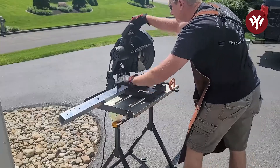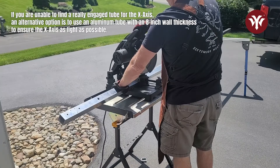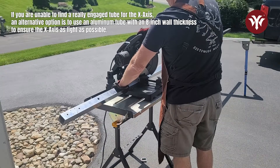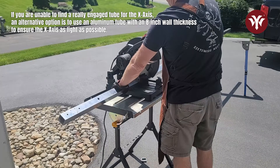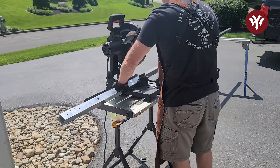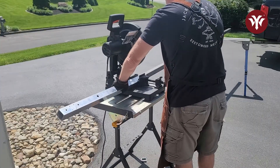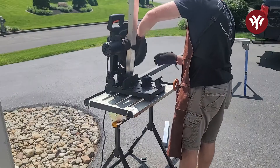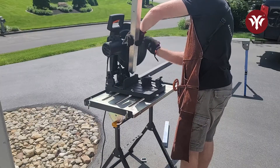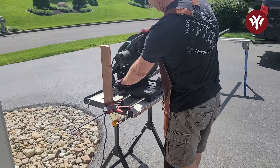The plans call for a really thin gauge tube for the x-axis, but the problem I ran into was my steel provider doesn't carry that thin a gauge. So I went on Marketplace and found an aluminum tube, eighth-inch wall, with the hope it would work. The ideal is to keep the x-axis as light as possible so it doesn't bow down from the weight.